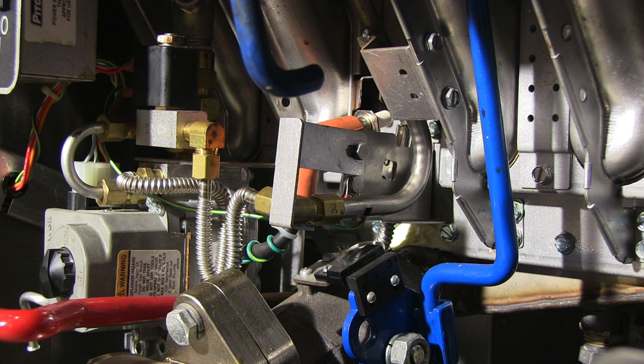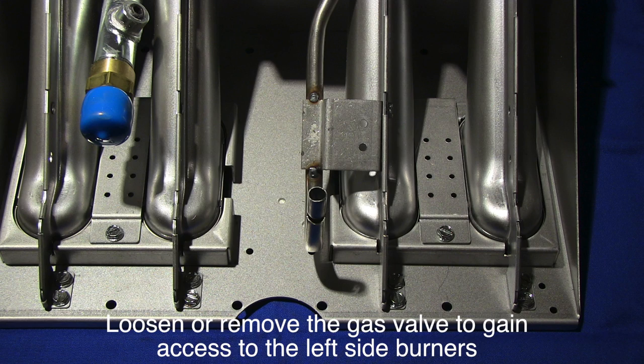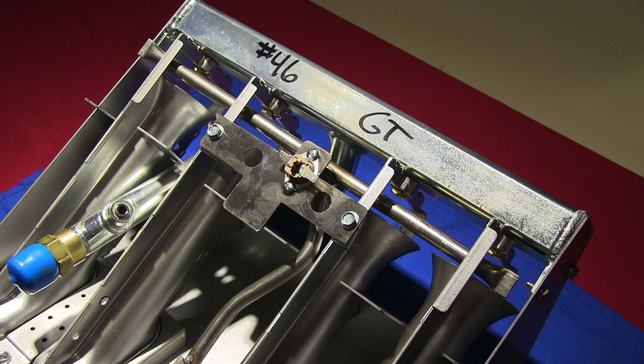To replace the multiple orifices inside the equipment, first remove the gas fitting, the pilot bracket, and the bracket for the self-cleaning burner runner tube. At the top of the burner assembly you must also remove the rollout switch mounting plate. Each burner is held in place with two screws. If your equipment has the self-cleaning burner system, you must remove the burners on the ends first, as you will need to slide them off the ends of the self-cleaning burner runner tube. The self-cleaning burner runner tube should now also come loose from the burner assembly once all the burners have been removed.